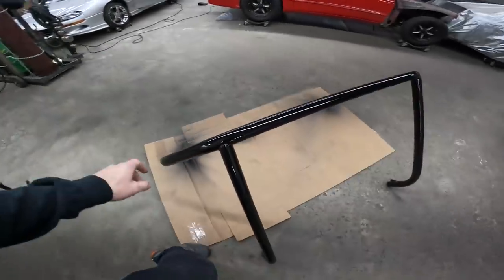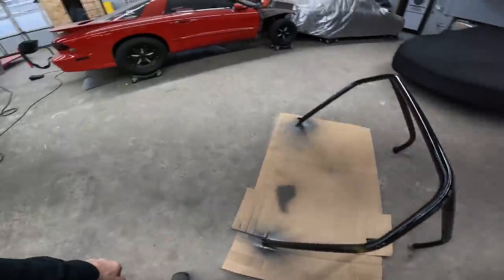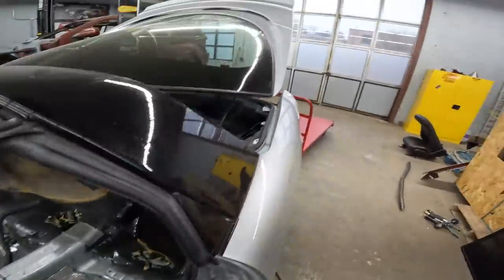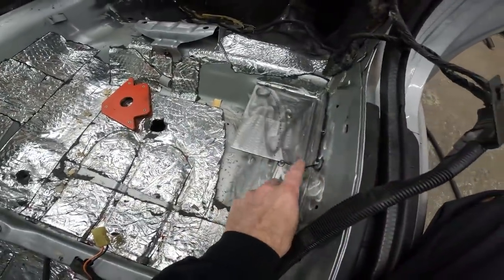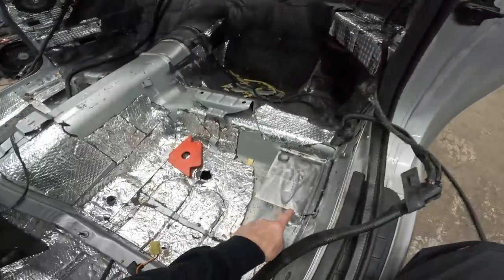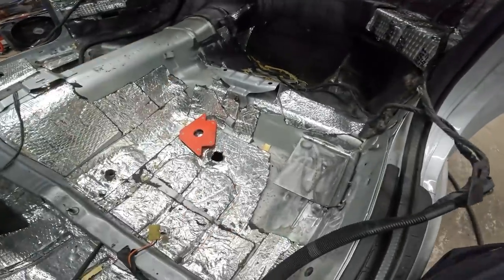We're back this morning. The paint is nice and dry so we're going to get this piece back in the car, get the tape off of it, and get this part welded in. But first we're probably going to take care of getting the plates fully welded before we reinstall the bar. We've got the plates tacked in where they don't move but we've still got to form this plate to the floor. I said I was going to TIG weld it so I might attempt that, but this body metal really sucks so I might just end up MIG welding these plates.